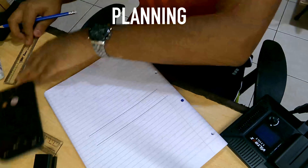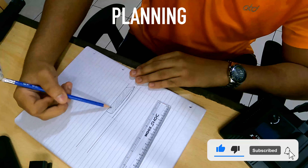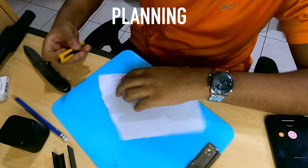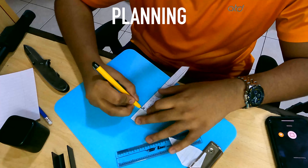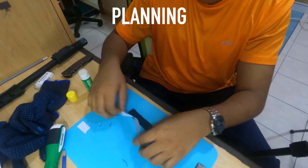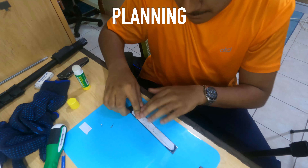The first thing to do while making a knife is to draw the design out on a piece of paper. So I take my time drawing the general design of the Tanto and then adding a few bits and pieces here and there so that it gives the blade some character. You can see that I changed the plunge line here. The next thing to do is to cut out the design — we should always leave a margin while cutting so that we don't have to grind exactly to that line. Here you can see me cutting the blade out and creating a template. Now, sticking the template onto the steel — it's better if we follow some lines of the steel and try to match it up with the template, which will make it easier while grinding.